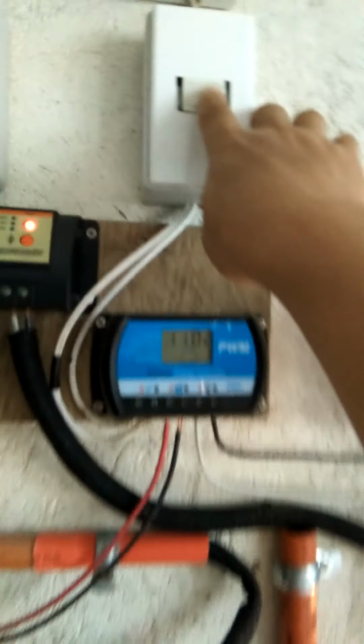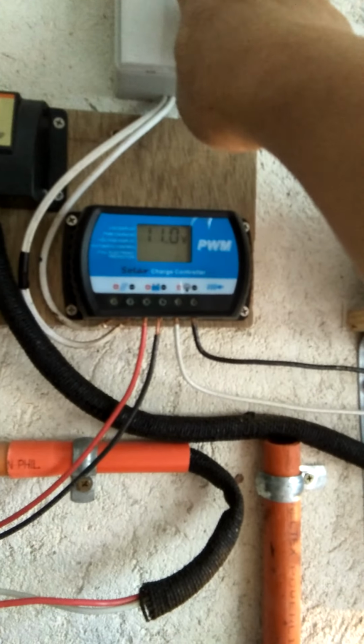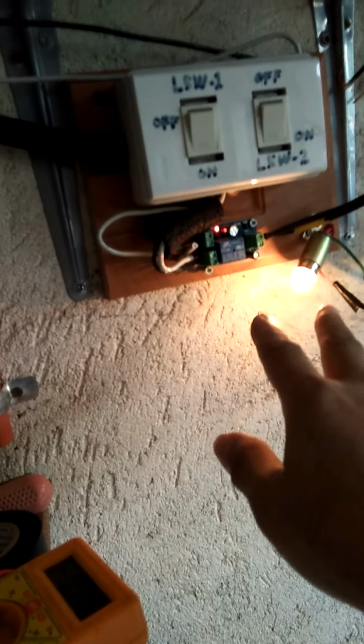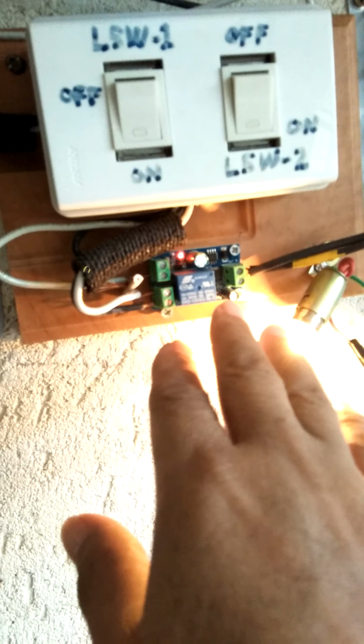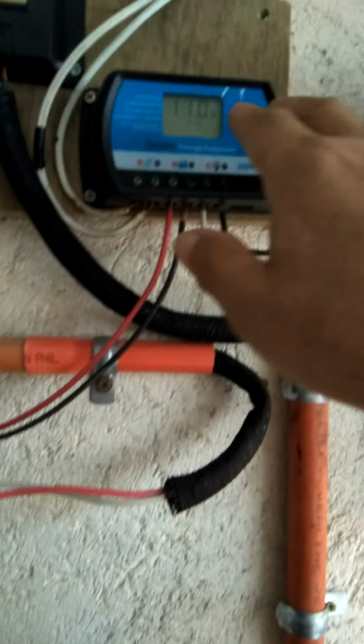Now I have to close the bypass to charge again the supercapacitor number 2. You see, it's switched over here. Switched over here to the other source, which is represented by supercapacitor number 2. So here, the ATS functioned immediately. It switched over to the DC load.